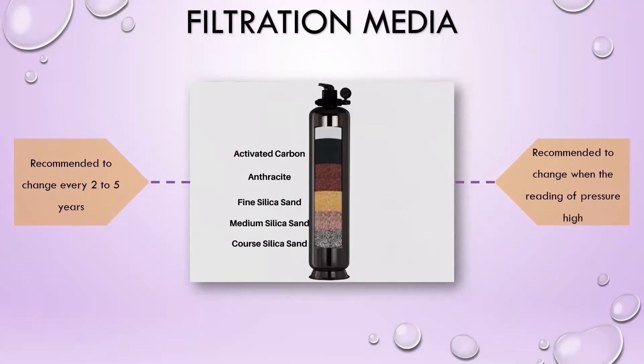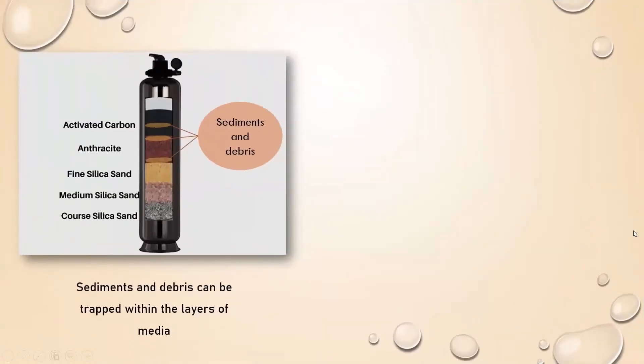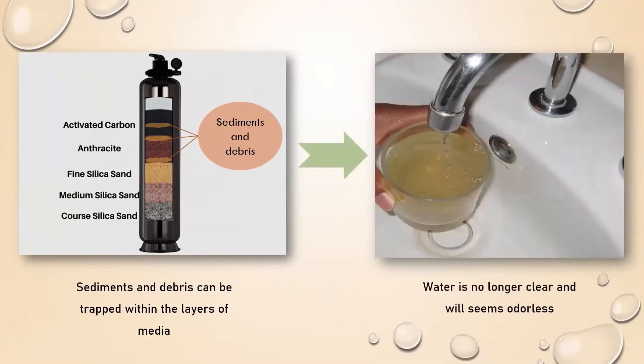This may also vary according to the quality of water supply at the consumer's residence, because the performance of the water filter may be affected in terms of water quality if the same media is utilized. The water is no longer clear and odorless after users return home and use the outdoor water filters after a long holiday — like after 1 to 2 months. Over time, sediments and debris can be trapped within the layers of media and this may permanently stain the media yellowish or brownish in color. Hence, the quality of the water will be compromised and the output flow will be greatly reduced. One way to revive the performance of the outdoor water filter after a long break is to perform backwash.